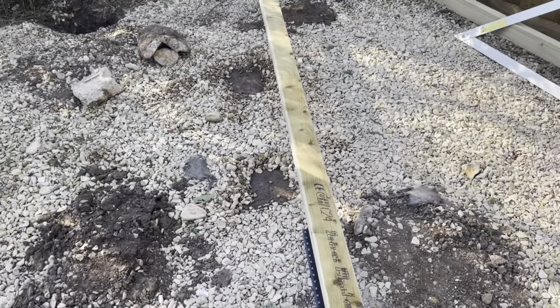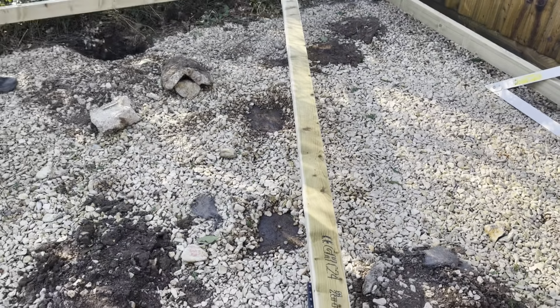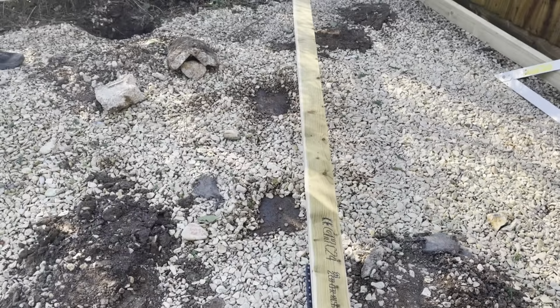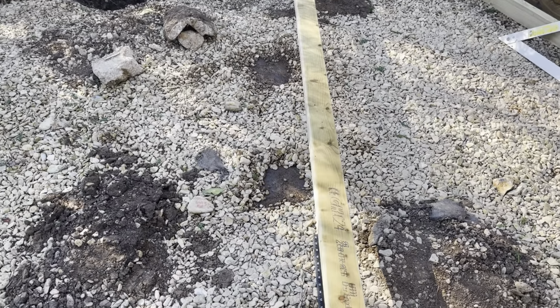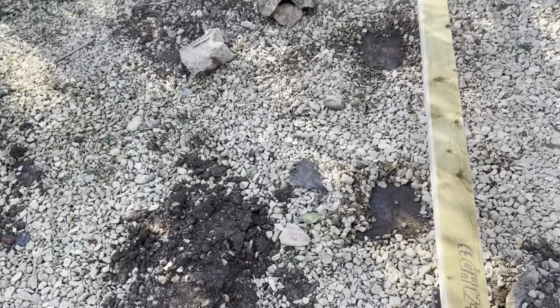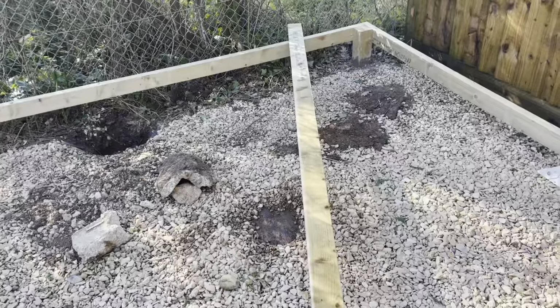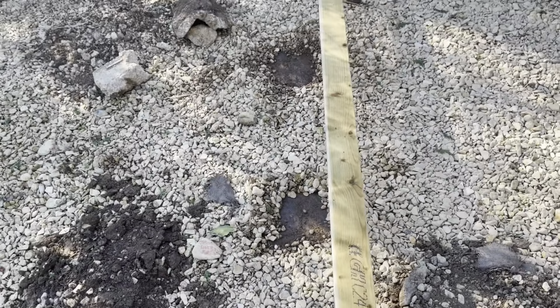Just following on more of what we did yesterday, but just continue to build the foundation. So we're just creating a plumb line. My plumb line, actual string, my plumb line is already spaghetti, so I've given up on it. So we're using some nice 4x2 that we'll be getting in. So that gives us a good line anyway. So we're going to follow these and we're going to have them centered. So going this way, we're digging down in here. So we've got three going that way.